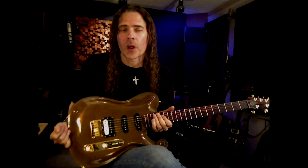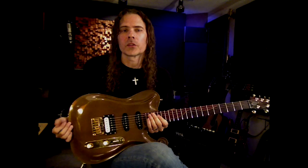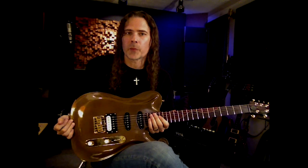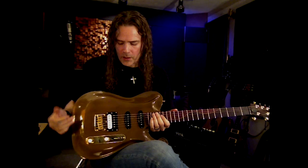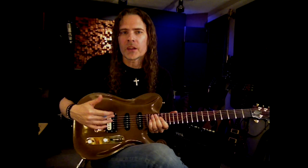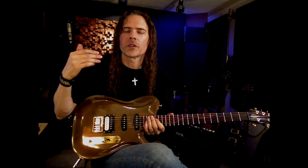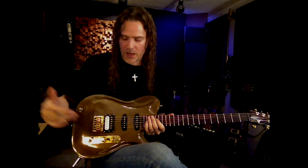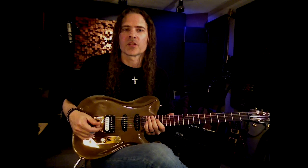Now there's also a couple other things going on in the electronics that are really cool that I'd like to tell you about. One is something called graphite shielding, and this is patent pending. Lamplifiers developed this. It's cool because graphite shielding helps inhibit RF noise, dimmer switches, various static and unwanted magnetics coming in and affecting the pickups, causing buzz and hum and that sort of thing.